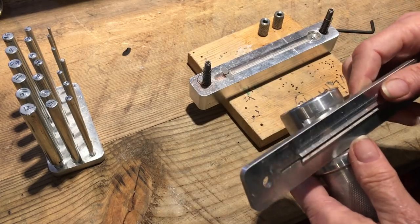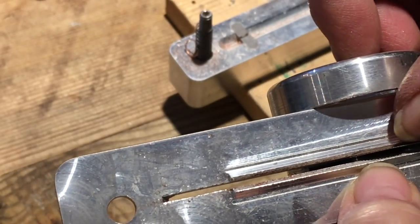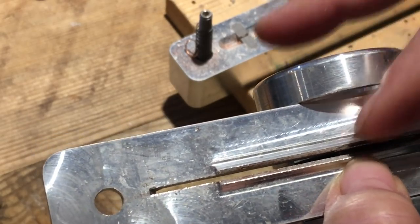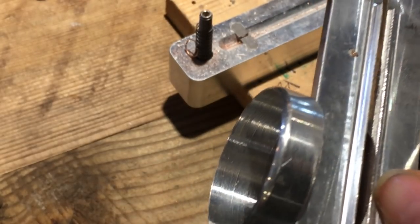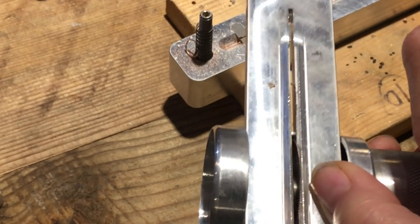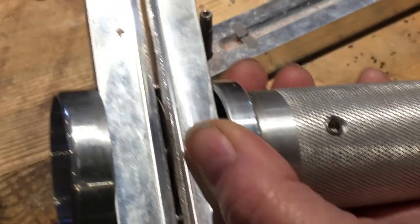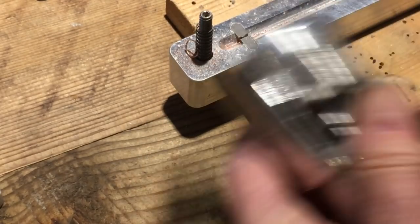Let's zoom in and see where that blade is. It's right up against the wall. So if you use it like this, eventually it's probably going to catch, or cut into the cutter, or the blade's going to break. We need to center it on the holder top. Loosen this and slide it so that it sits in the center of the track. Then, carefully without moving anything, tighten it down on the first nut. See how that's sitting in the center? Now tighten the bottom nut — make sure they're both tight so this doesn't move while you're using it.